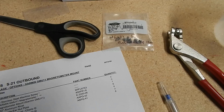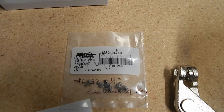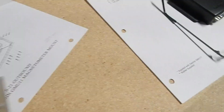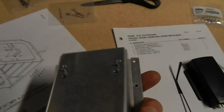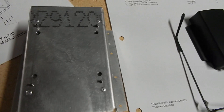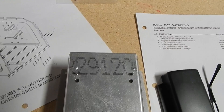I thought I was going to get lucky — I had some leftover stainless steel screws from the pitot mount. These are number 6 by 32 thread by quarter inch, but the quarter inch just isn't quite long enough to get through the base of the magnetometer and the two levels of aluminum and the nut plate. I need just a little bit longer, maybe 3/8 inch, so I'll have to get screws after all. I clicked out the nut plates from the bottom so my rivet gun could get on top and started riveting. These are fairly flush mounted, but the magnetometer is going to clear the rivets, so no countersinking or dimpling is needed.